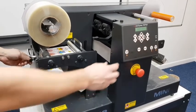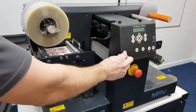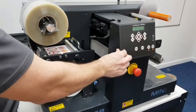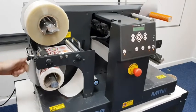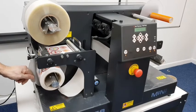If you put too much brake on, the machine will not have enough strength to pull the media through — it will just stick. That's when you've got too much brake, so take a little bit off. Just make sure that there is a bit of resistance there.